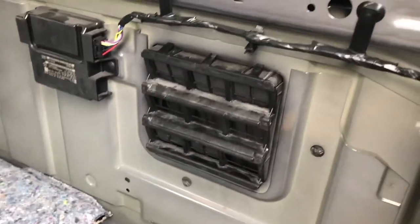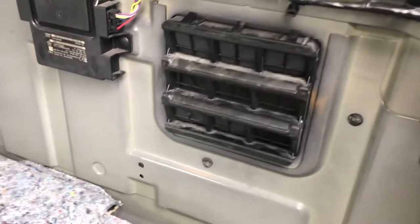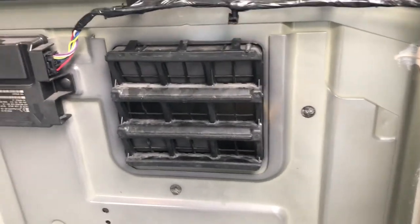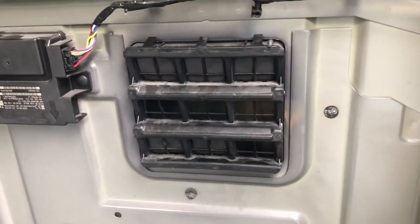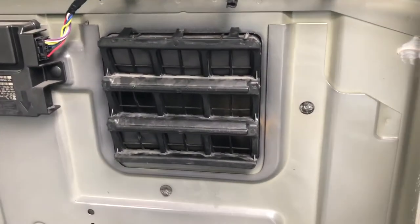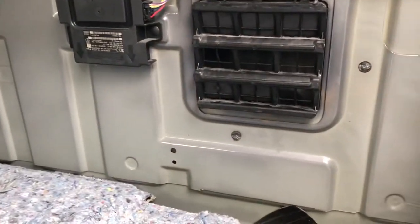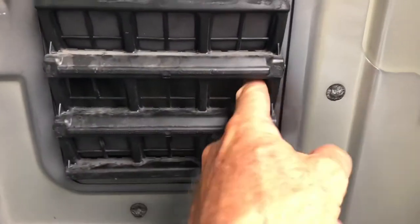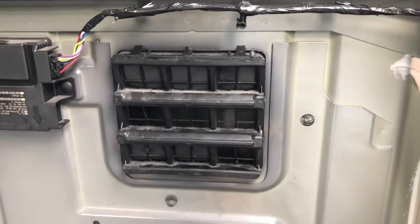A lot of videos on the reason you're getting water in your Ram — this is a 2014 Ram 1500 Express. It was getting water; pulled up the tool storage area under the seats and it wasn't the third brake light. I took off this piece and noticed water was coming out of these vents, and these vents, as you can see, are missing flaps. There are a couple here but all these flaps are missing.